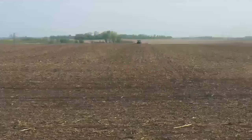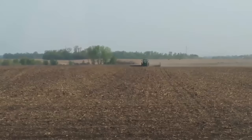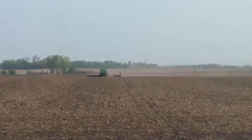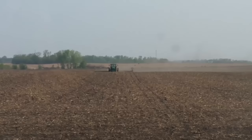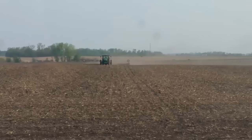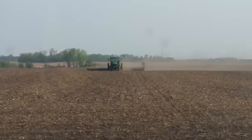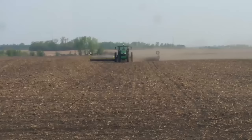After we're done planting, we do what's called rolling the field. The roller has big steel drums on it — they're hollow so they're not as heavy as they look. Basically he's going over the field to lay it out so it's nice and flat and level. It makes it much easier to combine — the header for the combine rests on the soil a lot more level, it doesn't pick up small rocks if you've got small rock issues, and it's easier to get all the way down to the bottom and pick up all the seeds so you're getting all the beans you planted. Some guys will do it ahead of planting.